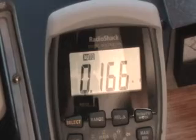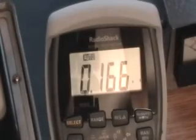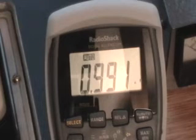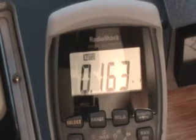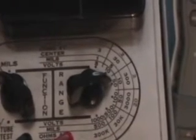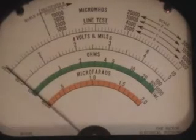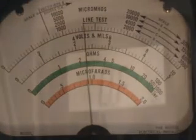Now showing capacitance — I have a 1-microfarad 600-volt DC cap. Looking at the digital meter, this cap reads .991 microfarads, so within tolerance of the 10% on the cap. Using the TV3BU, we can see we are on the 2-microfarad red scale. Zooming in on the meter and reading the bottom red scale, we should be somewhere around 1 microfarad — and we can see that we're at 0.8 to 0.9.